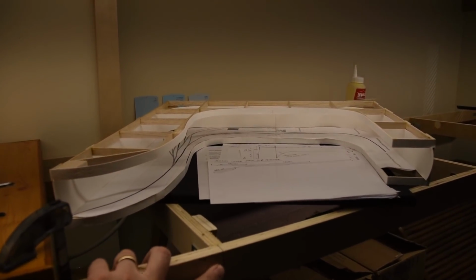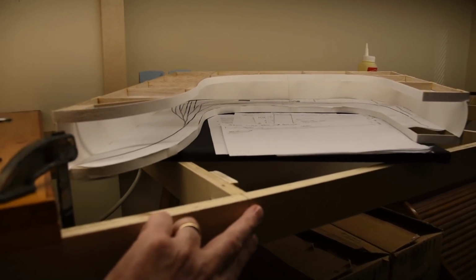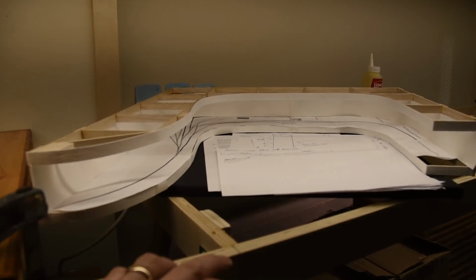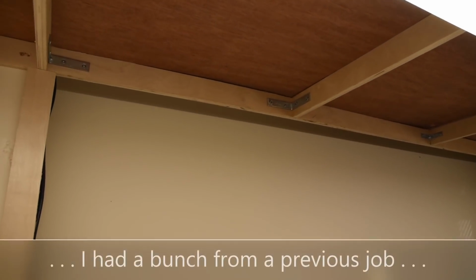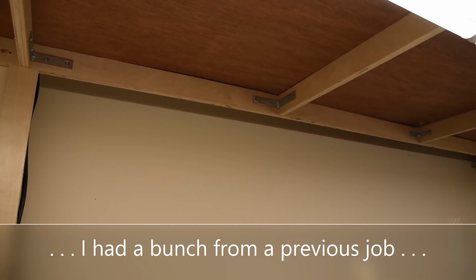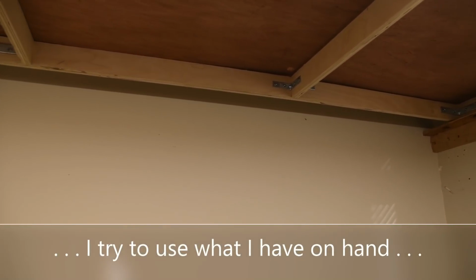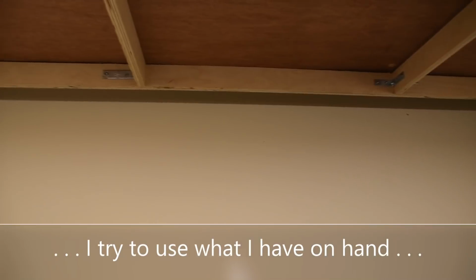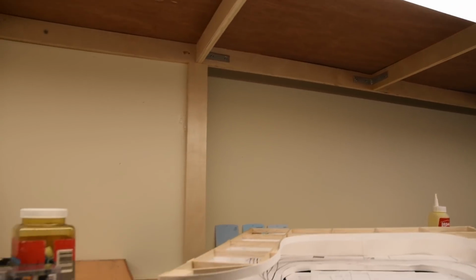Glue with 2 pins, 18 gauge, 1.5 inch, and then you can see up in the corner there, brackets. Metal zinc brackets. That's how I work with plywood. I've been doing it that way for years, and it works good. So, in case the wood wants to move, see, holds good. Oh, there's one, I missed one. I'll put it up there. And really, really strong, lightweight, and super strong.